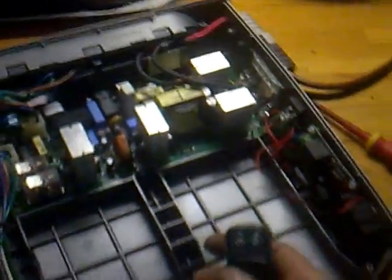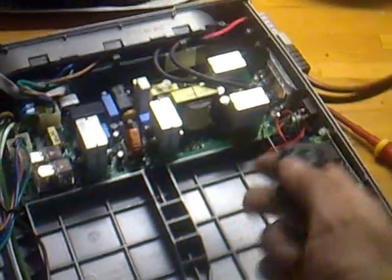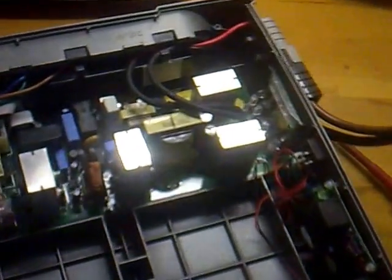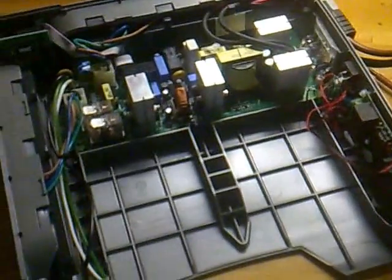This is how it works. If I press the button, I'll set it on just one channel — there are two channels here. If I hold the button it's the same as pressing it normally. It's flashing in this particular mode and it's running — you can barely hear it. This beeps every 10 seconds to let you know it's on. I can turn that feature off. If I want to turn it on and off remotely I can — all I need to do is press the button for three seconds and the mains will come on or go off.